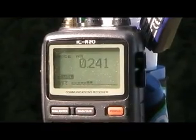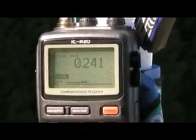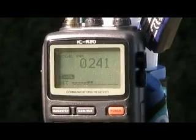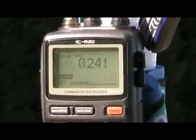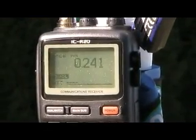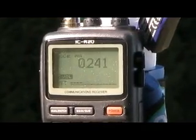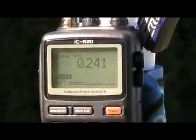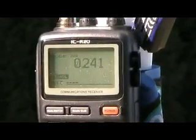Let's firstly explore the effect of disconnecting the lower wire from the ground electrode. So we'll still have about 1.5 metres of wire downwards but not connected to the ground electrode. There's quite a drop in the S-meter reading from about half scale, and a lot of buzz.